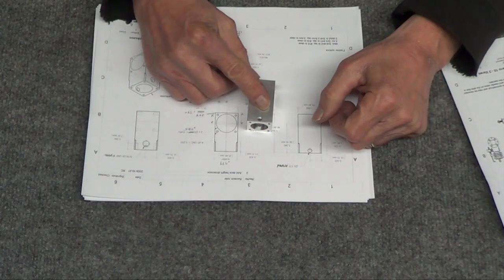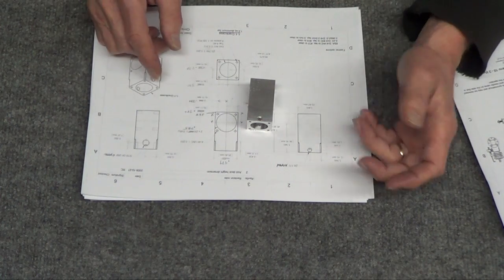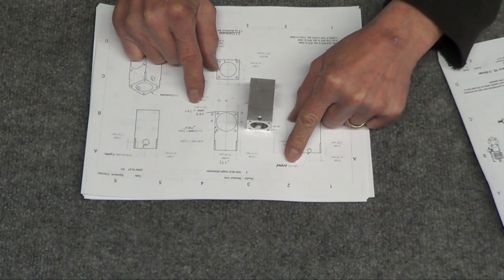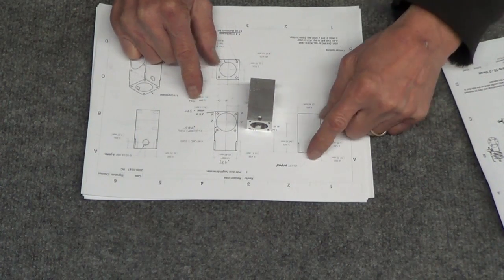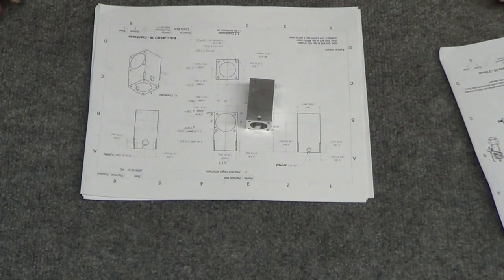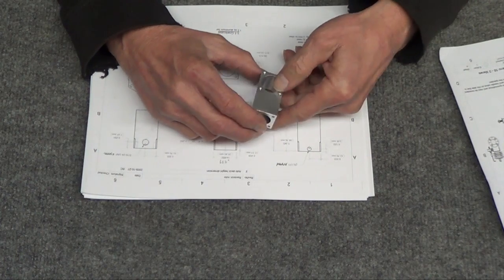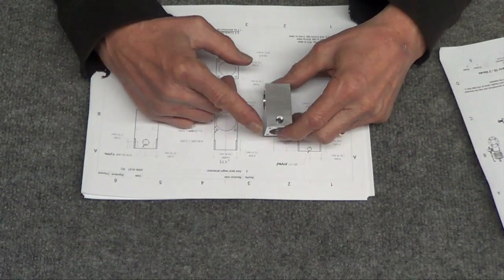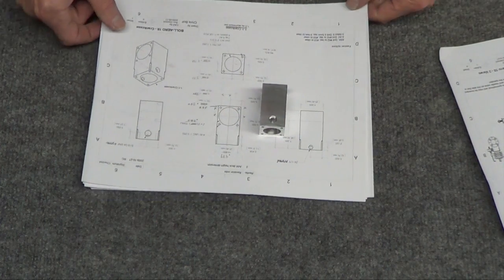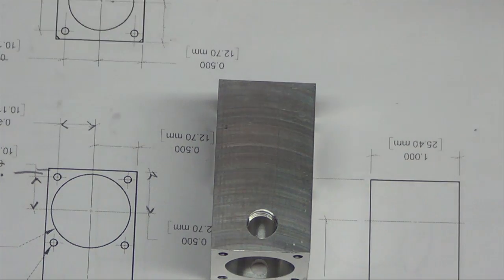So drill it out, and it's interesting, because everything here they have imperial first, and then they have metric below it. This hole is to be 1.177, that's a metric bit. So I drilled it, and it's right on the edge. I did hit all these edges, deburred it with the sharpening stone, so you can see all the edges. Let me zoom in a little bit so you can see more of this part here. A little closer, telephoto. Alright, there it is.